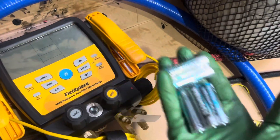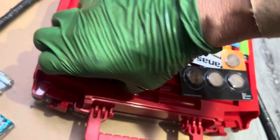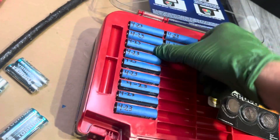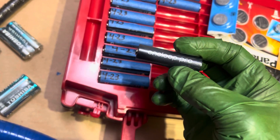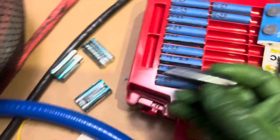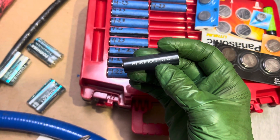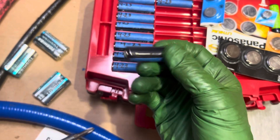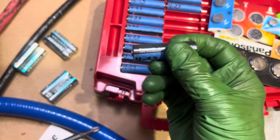Let's get some batteries. I'm not into using just any batteries — I like higher quality ones that last longer and are not going to leak. So I have Panasonics here, and I date all my rechargeable batteries. These are Panasonic Eneloops. They make white batteries and black ones. The black ones are great for higher output and more amperage in a short duration, but these gauges don't really need that. The white ones have more capacity and longer cycle life — around 1,000 to 2,000 charge cycles versus about 500 for the black ones.